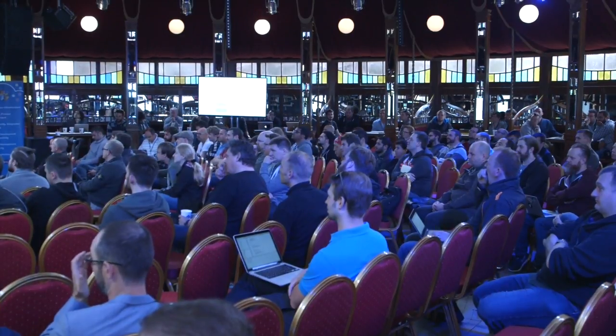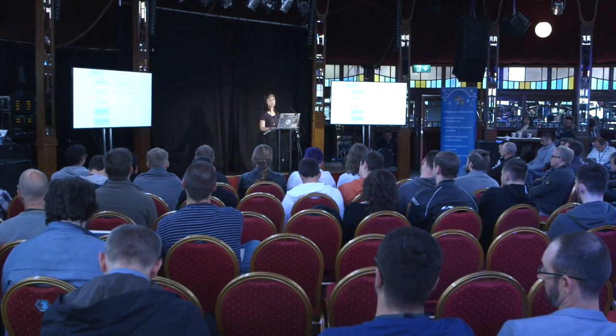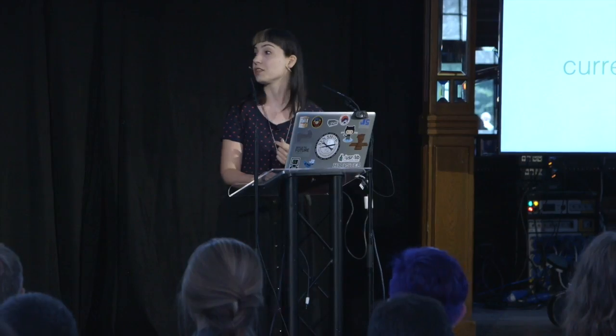However, I can store my microchip configuration, such as its clock speed and how much space it has, as a JSON configuration, which is really easy to read. There are also self-contained protocol and driver packages. Your programmers are your physical devices, and they speak a certain protocol between you and the computer in order to upload your code. Breaking the protocols and programmers down into bits means you can have standalone apps so you don't need the entire thing. You just need whatever programmer you're using, and that programmer will require whatever protocol it understands. That's a high-level look at what's going on so far.